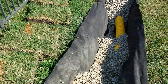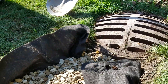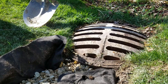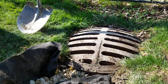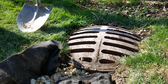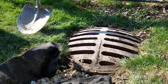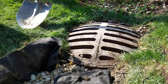One detail that a lot of people miss: they put a French drain in and expect the water to defy gravity somehow and come up out of the ground into the storm drain catch basin. You have to core and drill — go ahead and do a tap into the sidewall of this storm drain catch basin so that the water is gravity-fed right into it. This is the proper way to drain a backyard.